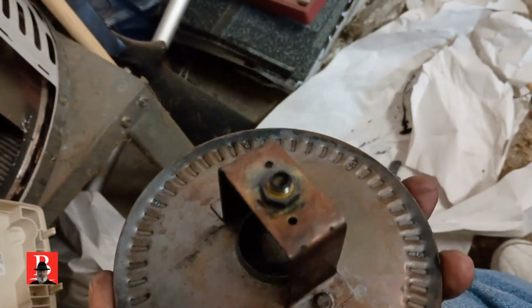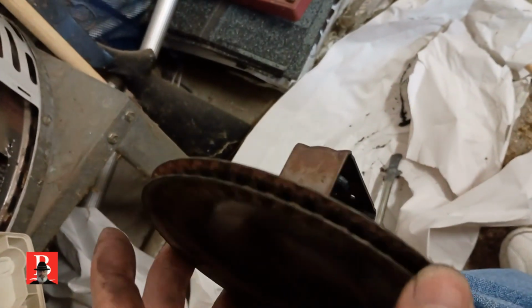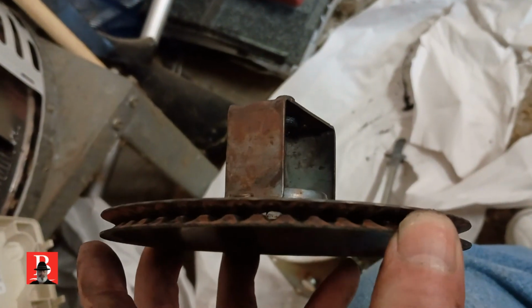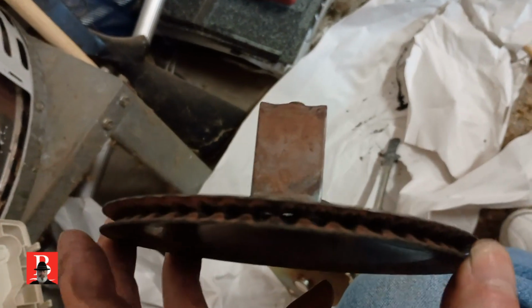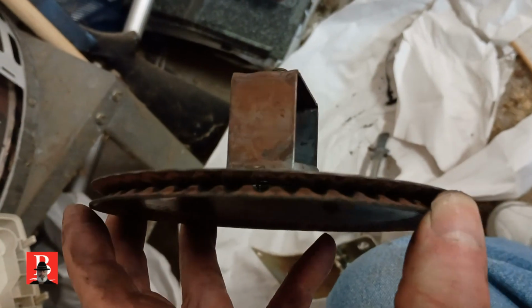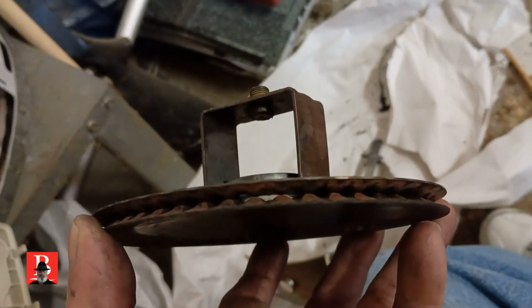Now, what you see on the end there, on the center, is the orifice. They did not ship me a new orifice to go with this assembly. Oh, yes, they did. Go back and look again. And the assembly itself is incomplete, so I'm half-tempted to just take the part back and use what I've got. But I'm going to go ahead and replace it, because I want to set a good example when working with gas appliances. You can see it's good and clear now. They got it opened up.